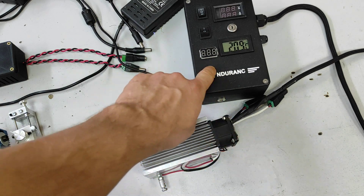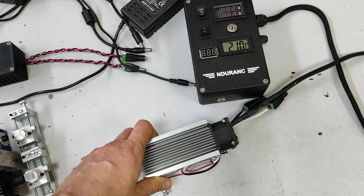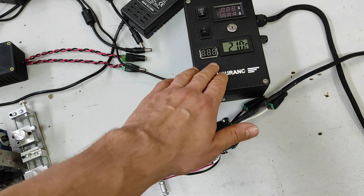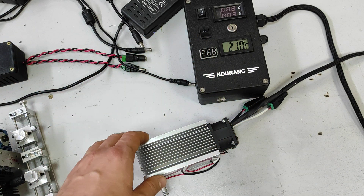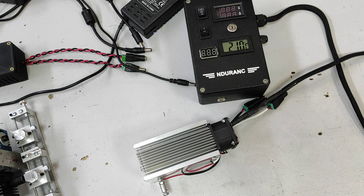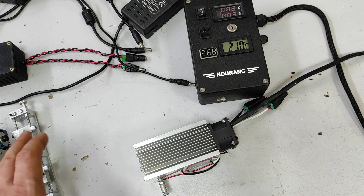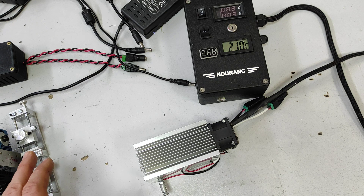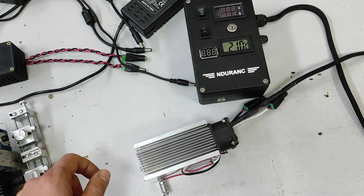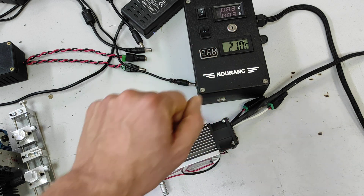The very important thing is that the laser should run within the right temperature range. For the 10 Watt Plus Pro, that's something like 15 Celsius up to 35 Celsius — you can run it at 40 Celsius but we don't recommend it, so 35 is maximum. For the 10 Watt SE we offer, we suggest a temperature of something like 15 to 25 Celsius. Once your laser is powered up to maximum power, you just need to control the temperature.